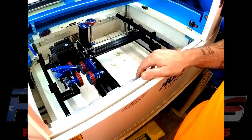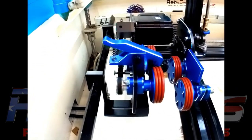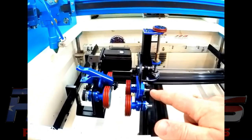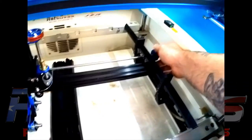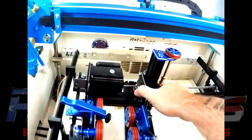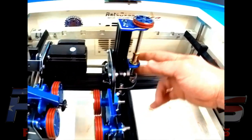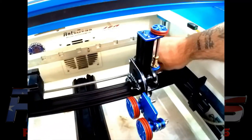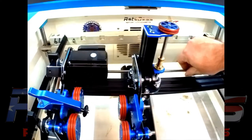These are completely 100% adjustable — you can move it back and forth on the machine, side to side. Just make sure that the motor plate and assembly is on your left-hand side and the slave wheel is to your right. You'll still have complete functionality of your lead screw. You can push it back or forward, release the washer on the backside and quickly pull it away, and you still have your adjustability. Push it forward and fine tune it with your lead screw.